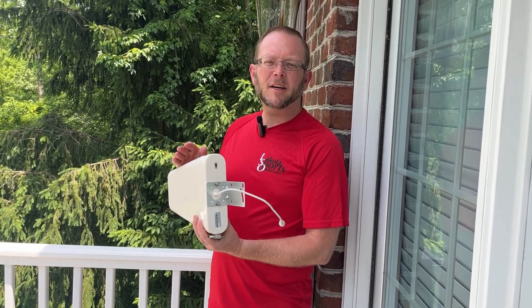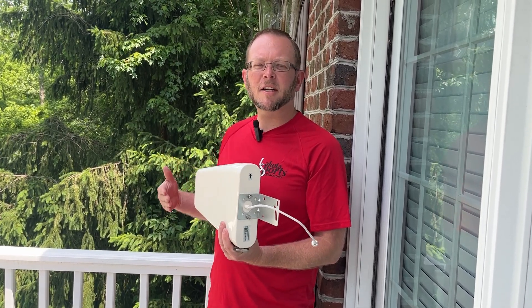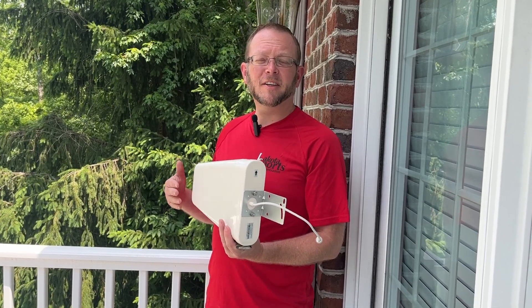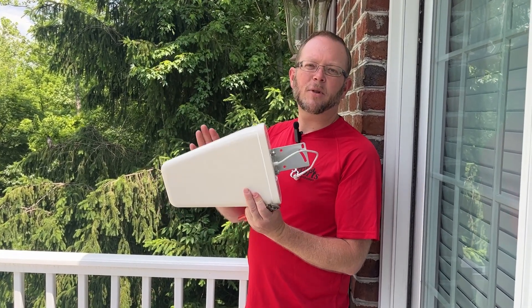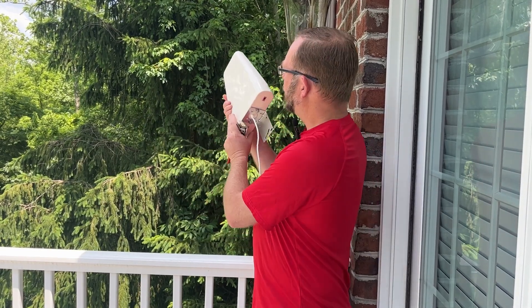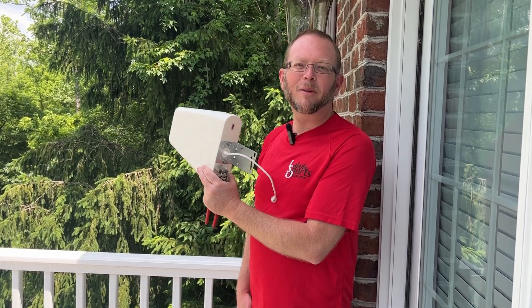There are multiple ways to help locate where your signal is going to come from best. I've looked at a map and also checked the cell phone signal. There are helpful hints in the installation guide that you can follow. Because the antenna is directional and cell tower signals are also directional, we need to point this to the tower so that we get a direct, line-of-sight connection. I want my antenna to face out this way, so I'm going to mount these brackets on my rail and then pass the cable through the door inside.